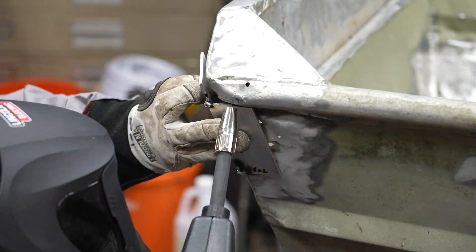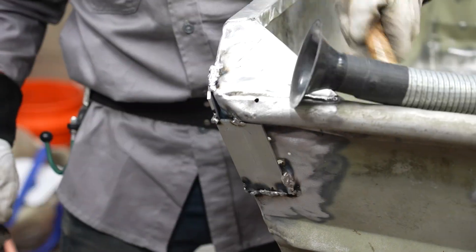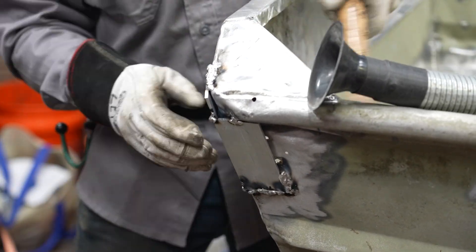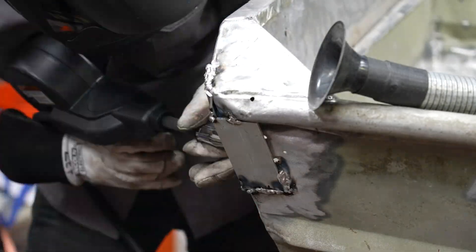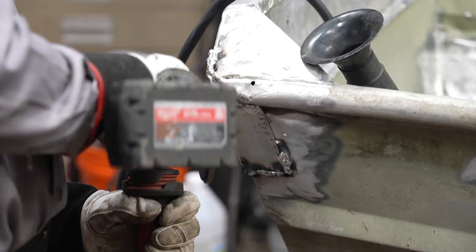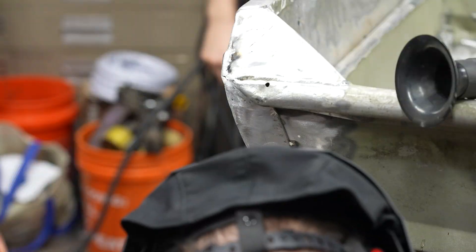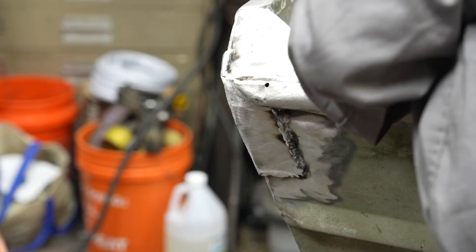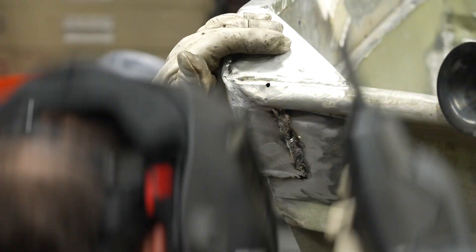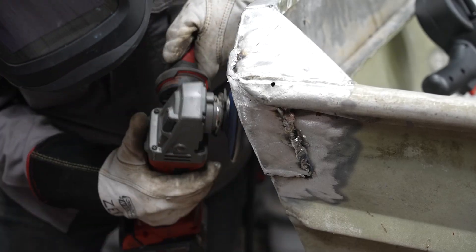On the other side of the boat, one of the upper corners had a pretty bad hole in it. Again, we used some plates and welded those on there and I have to kind of fill that corner gap. What I noticed was that as I was welding this, I was able to go in with a hammer or mallet and move the material around. Now had these welds cracked as soon as I hit them, I would have known that maybe my filler metal wasn't mating with my base metal. But you can see these welds remain flexible, which was a really good sign that these welds were going to hold up and that this experiment was actually going to work pretty well. As I start to blend that corner, things look a little bit better, and then I just have to run that bead up into that corner, which turned out pretty good. I blend that back in as well and sort of hammer things out from the inside. Anywhere that I did kind of poke through with my weld, I would weld in from the backside. In the end, I was able to get a really nice and secured corner.